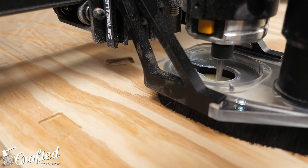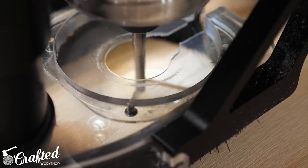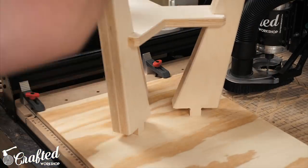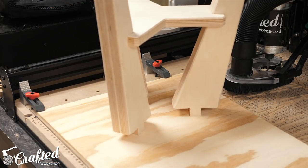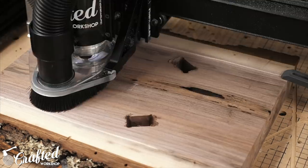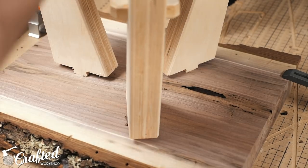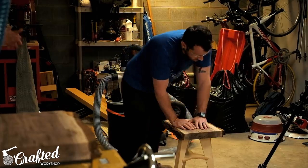Next it was time to cut the mortises into the bottom of the slabs, and instead of going straight for it we decided to run a test cut on a piece of plywood first just to confirm that our spacing and sizing of the mortises would work. There's always a fine line between too tight and too loose when milling mortises this way, so it's really helpful to do a test cut to confirm your settings. Once the test cut fit nicely it was time for the main event — cutting the mortises into the slabs — which went really smoothly. After the mortises were done we could finally test fit the whole piece and it was incredibly strong even with no glue.